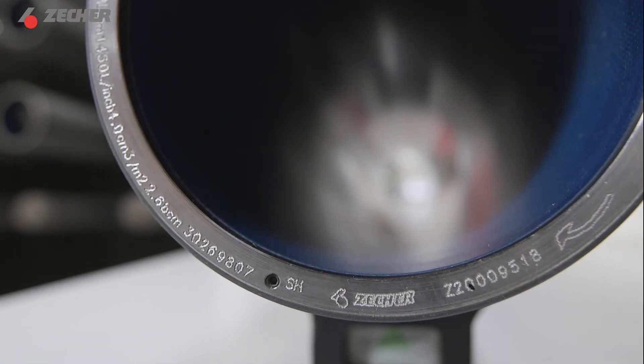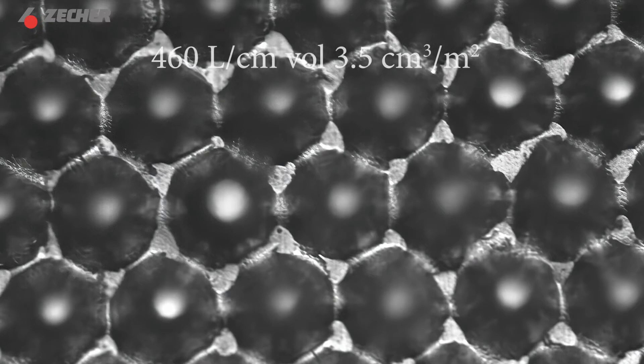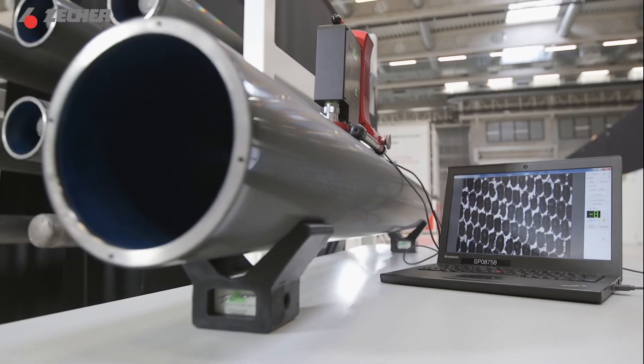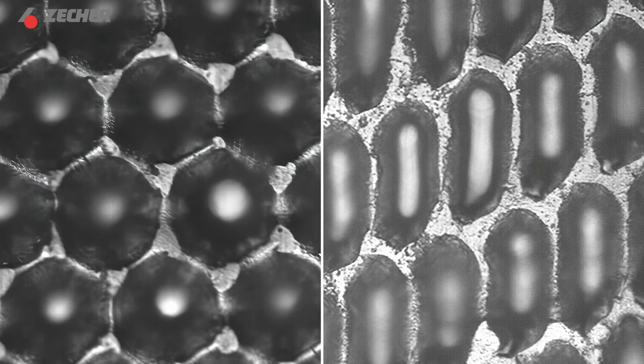To the naked eye and from afar they both look the same. So what makes them different? Let's take a closer look through the microscope. Here we have our hexagonal engraving, with a standard specification used in flexo printing to achieve outstanding and photo-like print results. Now let's meet our challenger, the Zecha Stepped Hex Anilox, 580 lines for even more superior resolution without loss of volume. As you can see, the Stepped Hex is an engraving based on the traditional hexagonal geometry. Yet here we have an open structure allowing for improved emptying behavior during printing, which also makes for easier cleaning in return.